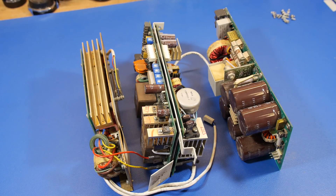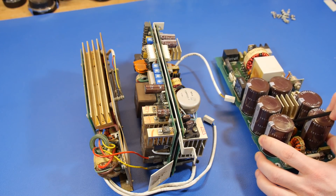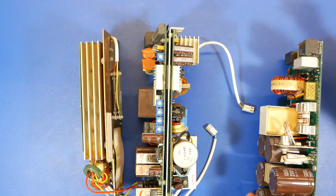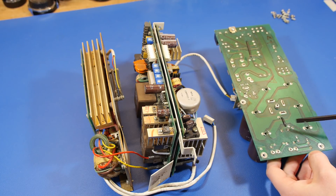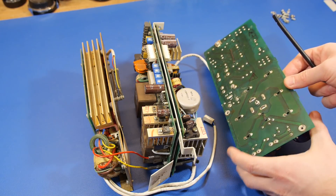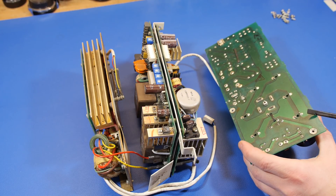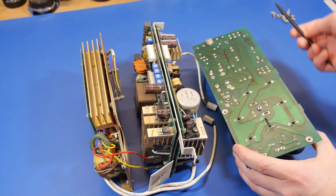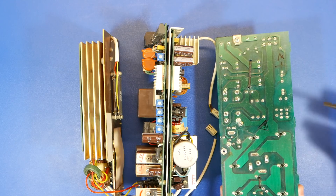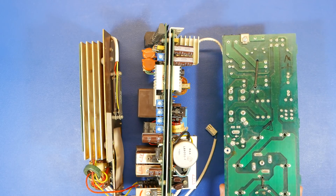With the shell out of the way, let's take a closer look at these cards. You have the input card here — it looks well laid out. The rectifier is appropriately heat-sinked, you have higher current capacity, and there are fast-blow fuses of decent size. What's also nice is there are relief holes underneath these capacitors so that if they fail, they can do so without causing further damage to the board. Looking at the edge of the PCB — this is the one that goes through the case — they left about a quarter of an inch between the case edge and the traces, and the power planes are large on this board. Some good thought was put into this.